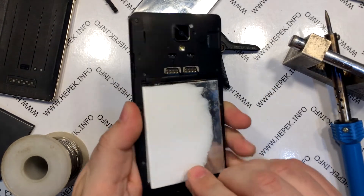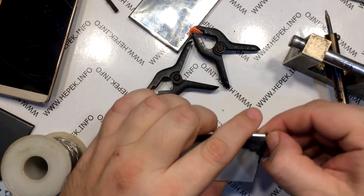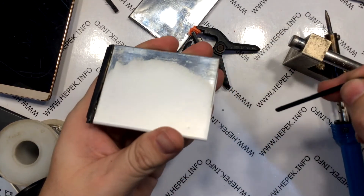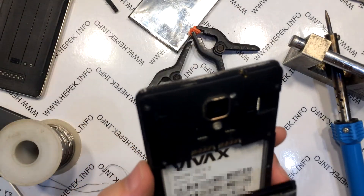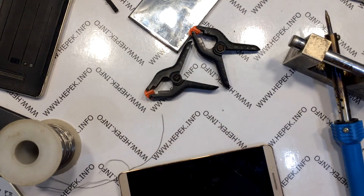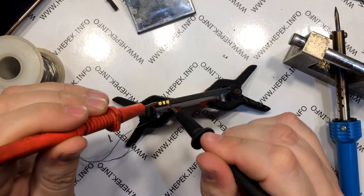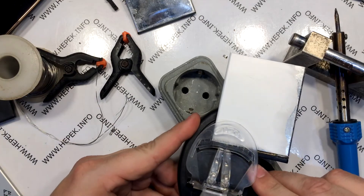The battery is a little longer by a quarter of a millimeter — just the thickness of the plastic on the bottom side of the battery. I just peel it off. And I still decide to measure the battery voltage first to determine the functionality of the battery. Unfortunately I did not record the measurement result, but since the battery is not charged enough, we will let it charge a little bit more with the universal charger.